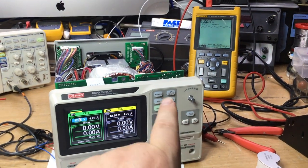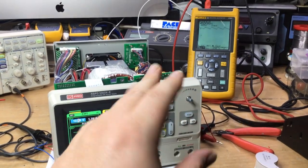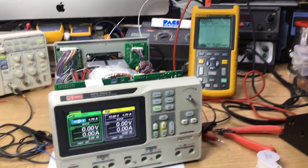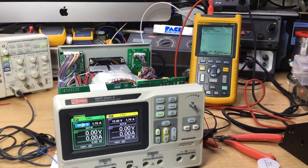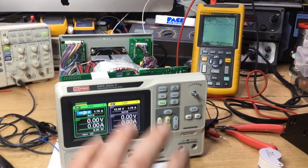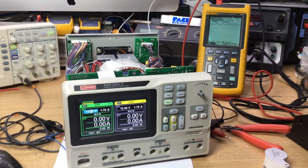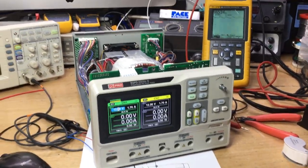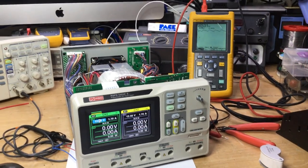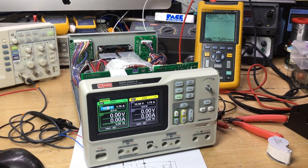But that isn't happening. Those capacitors are staying charged, and it takes several minutes to reduce from 2 point something volts right the way down to below 0.6 of a volt. So it does look to me as if it isn't a load issue externally from the bridge rectifier. I think it's just the bridge rectifier itself has weakened over time and the thermal runaway is occurring, and thus it's breaking down as it's getting hotter.